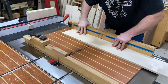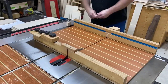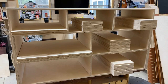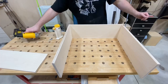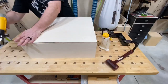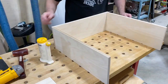I've got a little trick here for you. You don't want to put your piece when you're cross cutting on a sled directly up against the fence — that's no bueno. You want to use a stop block to give yourself some clearance. When I put these together, I'm going to show you a little trick I use on the bench. Once all these pieces are cut, I lay them out and get them all organized. I take my Armor Tool bench and a Rockler 90-degree angle piece that you're supposed to attach on the inside of a piece, but instead I put it through the dog holes, use hold fasts to keep it in place, and then use it as a 90-degree reference to tack these drawers in place. It builds them pretty quickly and pretty easily.